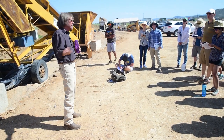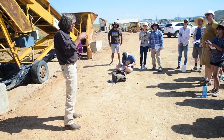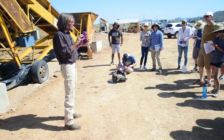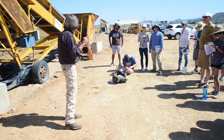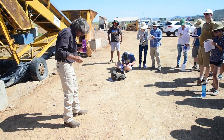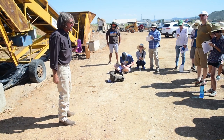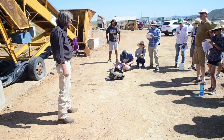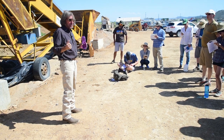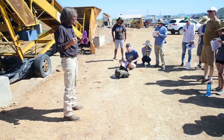With lime, it's exactly the opposite. The lime doesn't care anything about the sand and gravel. It's the clay. It loves the clay. Clay has a negative electrical charge. Sand, gravel, and silt are neutral. Clay is a negative. That's why it's sticky. That's why if you walk around when it's wet, your shoes look like Mickey Mouse. It's because of that negative charge that the clay has. And the clay and the lime really like each other. They would like to get together. They're attracted to each other.